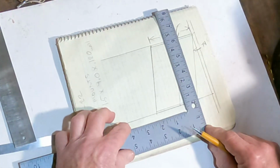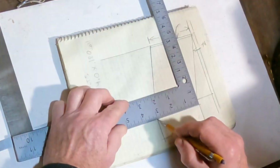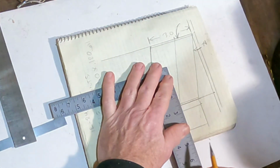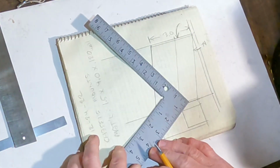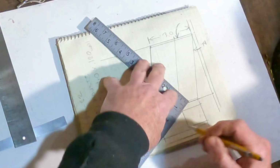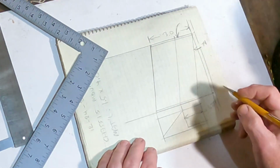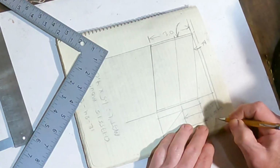Then what we will do is a side view now. Draw a reference line right there. It's a 1 1/4 high. There's our full tubing, but what we're going to do is notch it right there. We're going to angle it like so. So this is going to wind up being 1.25. Cut to base.